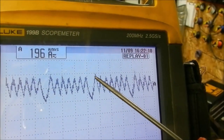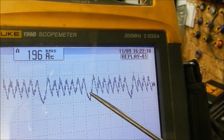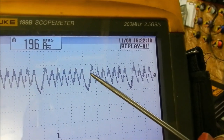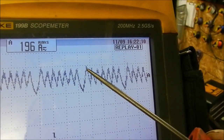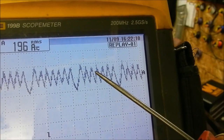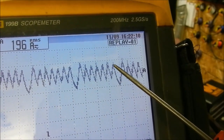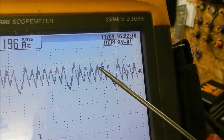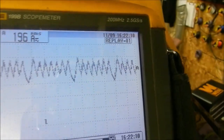The reason that spike is higher is because the crankshaft actually sped up when it did not have all the current draw on it, so the starter was able to speed up the motor. Then it compresses faster, getting a higher spike when it reaches max compression on that stroke, because it will draw a huge amount of current all of a sudden. So that one goes up and the rest stay level. If you see one high, that is not an alarm — because the one before it is low. If you count: 1, 2, 3, 4, 5, 6, 7, and then there is your missing one. Eight cylinders — it is a V8, it makes total sense.